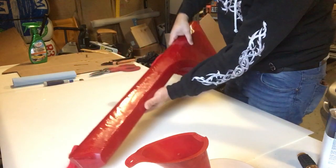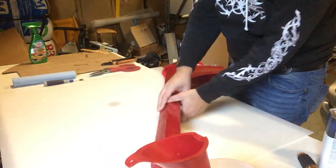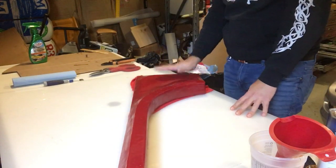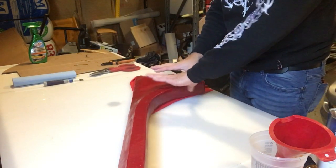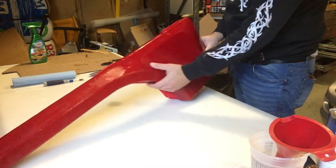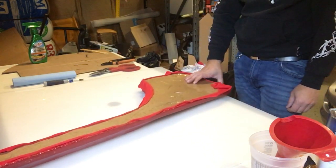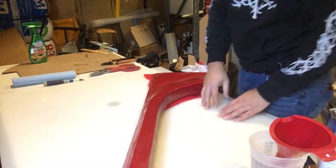But when I tried to pull it off, I could see that the cloth is so thin, especially because it was stretched out, that the fiberglass is pliable. So what I'm gonna do instead is put one more layer of fiberglass cloth over it, with resin, and then the outside will be somewhat finished. But before I do that, I'll trim it. Well, I shouldn't say it'll be finished, because I still want to do a gel coat on top, but then I could reinforce it from the back with some fiberglass mat. So for now, I'm gonna have to trim the extra material here, so that when I put the mat on, it doesn't tuck underneath. It goes out, so that way I could pull the part off the mold easily.